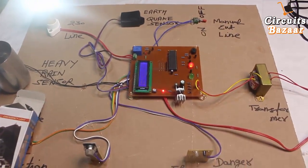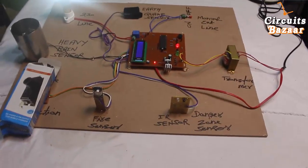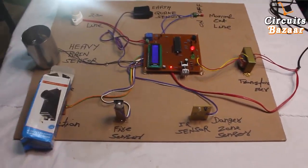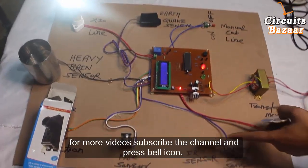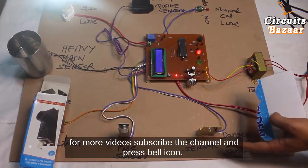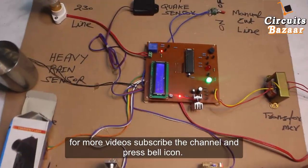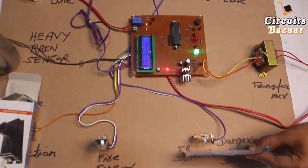Substation is in good condition. Now for the remaining sensors — this is an object in front of the IR sensor. Note that IR sensors are not capable of sensing black objects because one side transmits IR radiation and the other receives it. When any object comes in front, you can see 'Object detected' — that is the message on the LCD: 'Object detected in the proximity.'